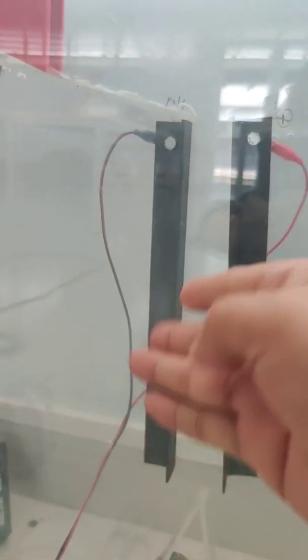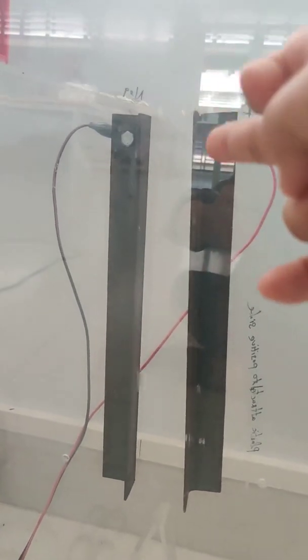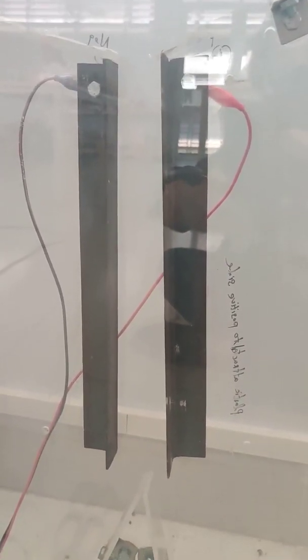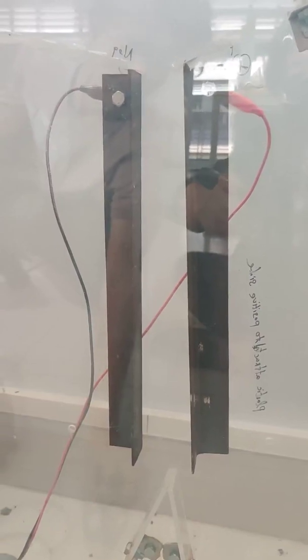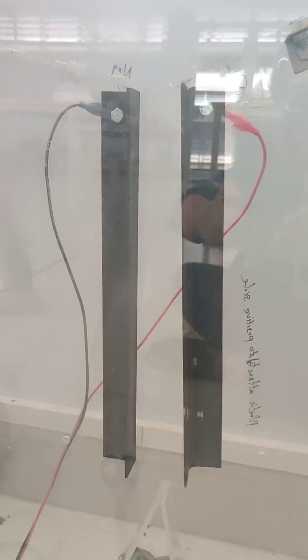The electrode on the right side is a positive electrode. The electrode on the left side is a negative electrode. Right now, the charged waste products are being delivered into this separator. You can see that the wanted item, which is charged, will be electrostatically attracted to the positive electrode on the right side. The unwanted item will be electrostatically attracted to the negative electrode on the left side.